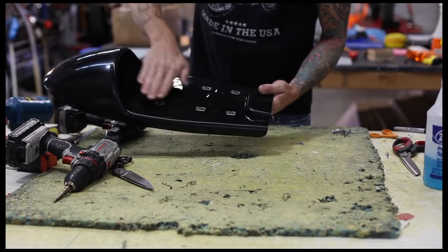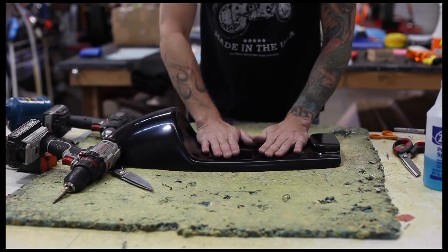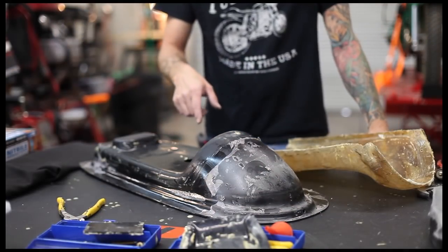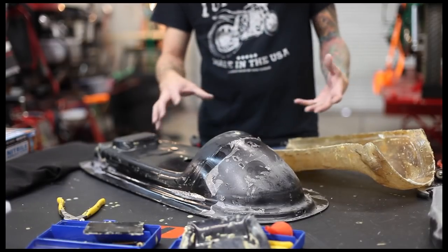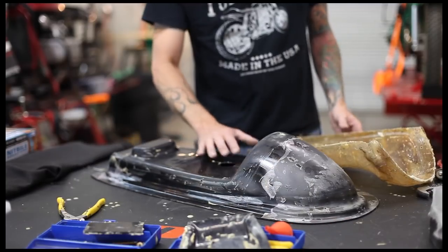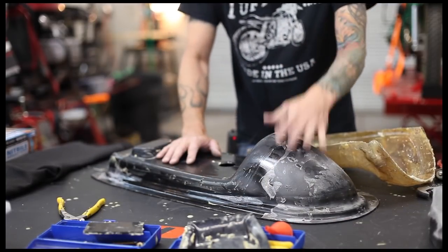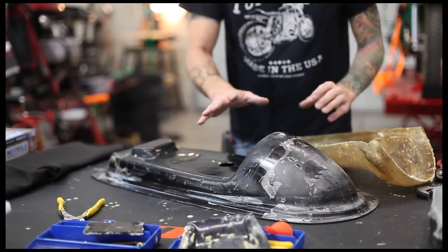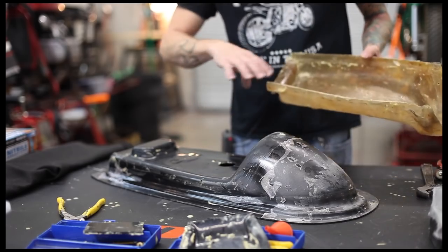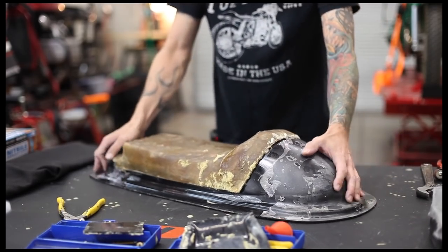Now the foam is going to be on top of this — you're not going to feel it. It's not going anywhere. To make the foam for the cafe seats we use a two-part liquid polyurethane foam that you mix together and it expands into a mold. I made molds of each seat, most of the cafe seats anyway. I got to prep the mold, put some mold release here — it doesn't look fancy but trust me, it works. This is a foam shape on the inside, so we pour the liquid foam in here and when we're done we'll peel out the foam.